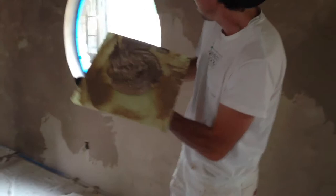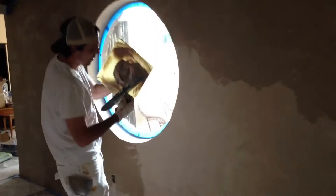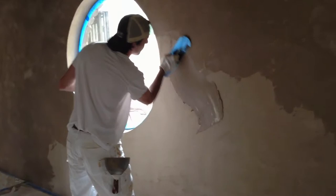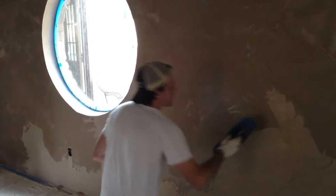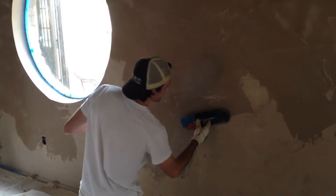One issue with this finish is being able to get these colors up close together. When the mud is wet you're seeing that design. I'm going to put all this material on in one of our puzzle pieces, and I'll do it in an abstract fashion so that the designs stay abstract. I'm not burning it off too hard — just smoothing it out. This adobe wall's got some contour to it, so I'm adjusting to that in the direction of the trowel.